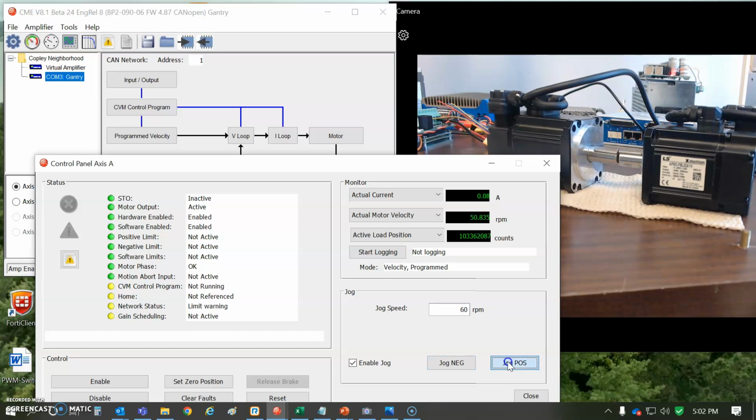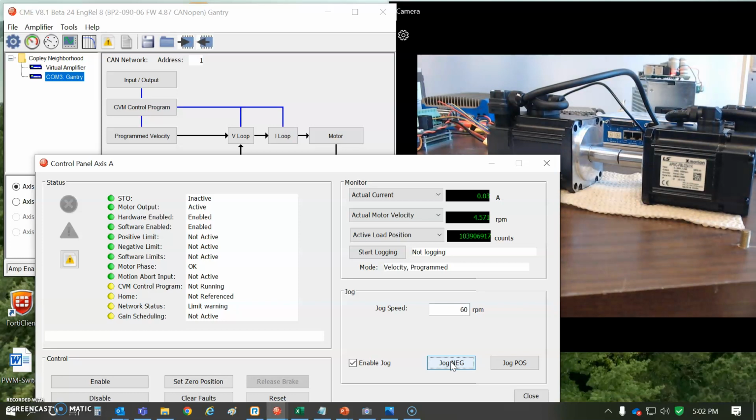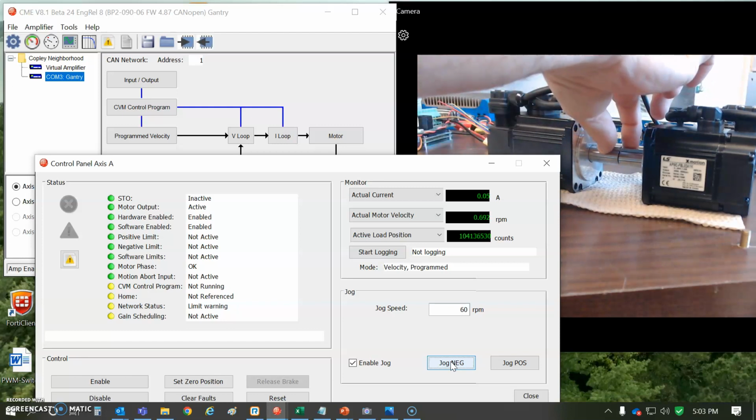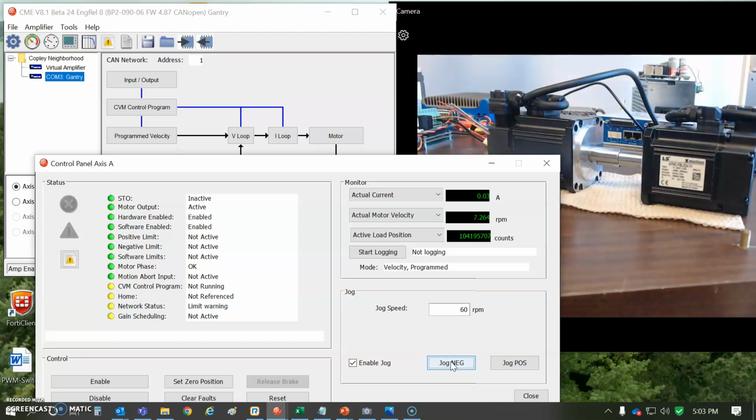Anyway, so I can move them together, and this is not the cleanest mechanical system here, but forward and reverse, they're both doing work on the same load, and the tape is starting to come off, which is okay, just as planned. So you can see they're commanded with zero velocity, but there is some motion on it. It's just a torque. So I can easily, I got like 0.05 amps here, so I can put them together again, but they tend to try to split apart, which will get rid of the deadband in the gear, if there was a gear between them.